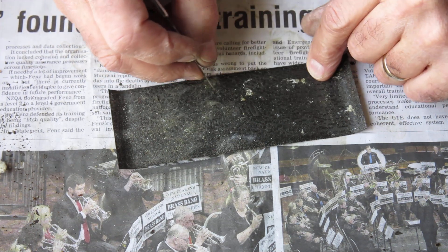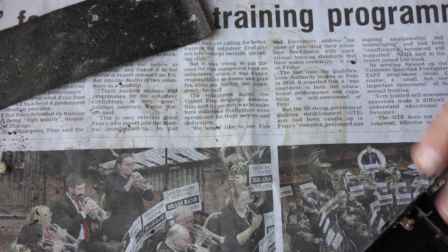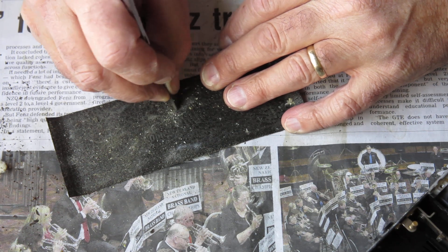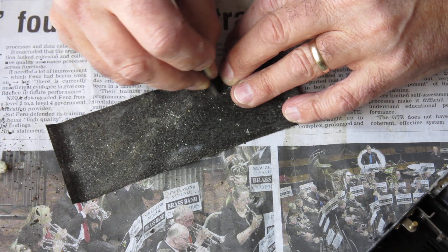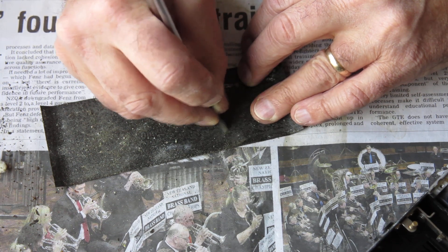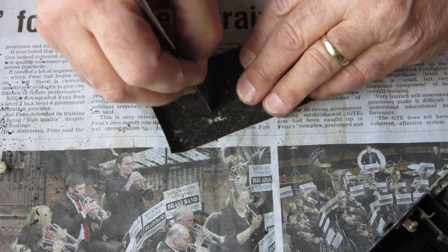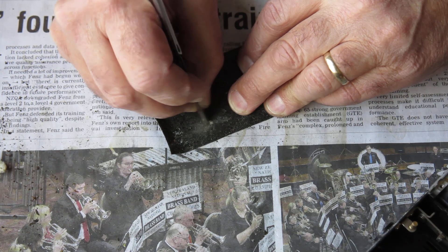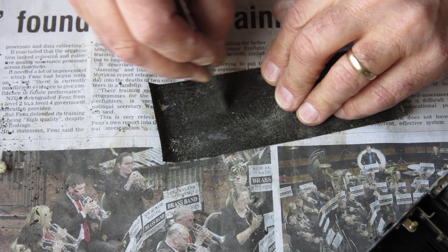Some of these bumps will fall where there were rivets on the back cover. That's where you've got dissimilar metals and you have salts or something else creating a bit of an electrolyte with some moisture, and that just causes the metal to corrode.